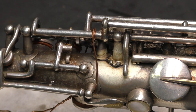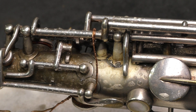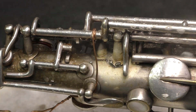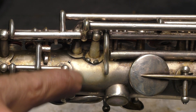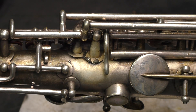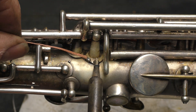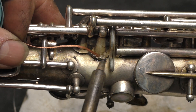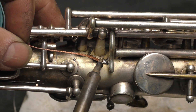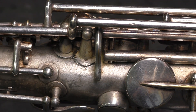That definitely sucked up some solder right there — that's all we need. The closest thing I got handy is 409; I'd like to get the heat out of everything as quick as I can. This should have been done fully disassembled — I am completely cheating. I ended up with a couple of blobs of solder there. Let's see if I can get those blobs warm enough to suck up with some solder wick. It's good and solid. Cleaned up pretty nice — not too bad for an onboard soldering job, as in everything else was onboard at the time.